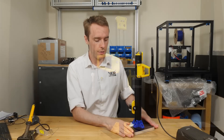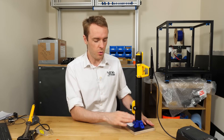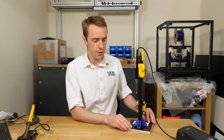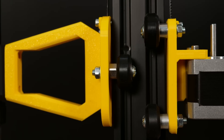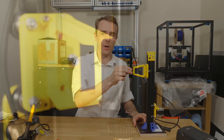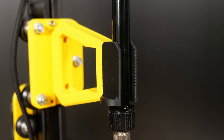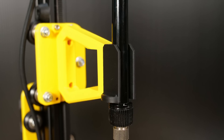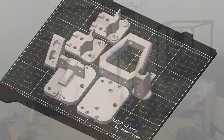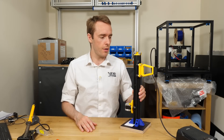For the base at the bottom, I've just used a piece of plywood that I had laying around. You could 3D print a base or some slightly different legs if you wanted to. It's about 150mm square. For the printed parts, pretty much all of mine are PLA with the one exception being this grip — PETG would probably be fine, but I've gone with ABS just to be safe. For the quantities, orientations, and STL files for those printed parts, all of that can be found in the video description. The orientations are already preset to the orientation that you need to print them.